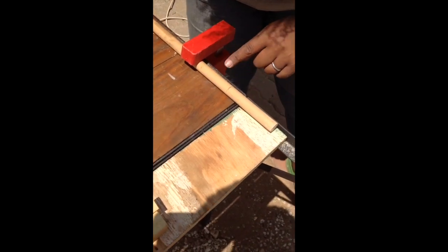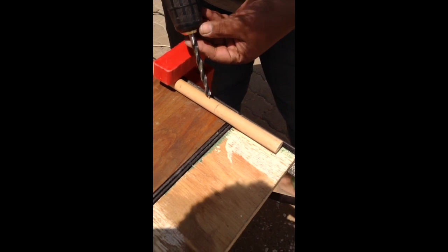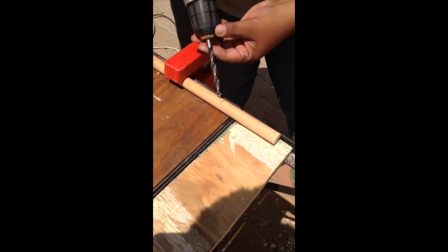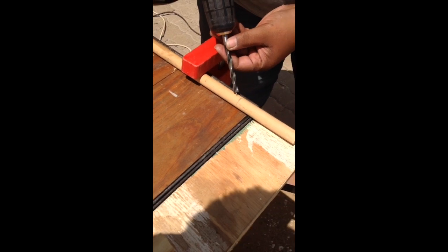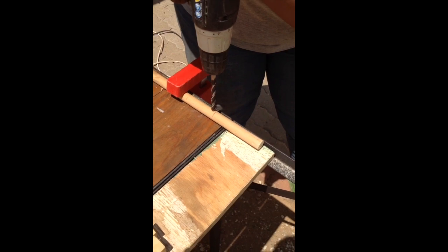Back to our dowel. And as you remember, we had to make these two little holes there with either a nail or, in my case, I had a marker. So we're taking a drill bit, we're getting our drill, and we want to drill 2 holes into there that will fit our dowel. All right, so let's get started. Make sure that marker hole, this is a wood drill bit. You can recognize a wood drill bit by the little sharp point at the start of the drill, and you make sure that it's level and we're drilling down.